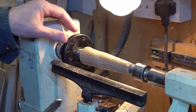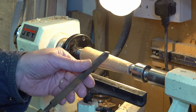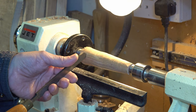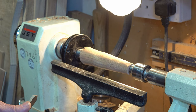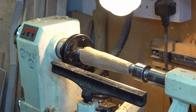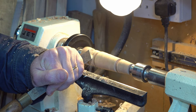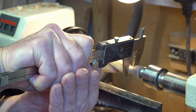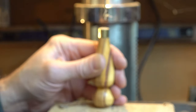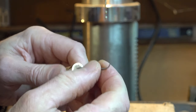I'm developing a bit of a technique for these — this is number three that I'm doing — where I just get them roughly round and then use my parting gouge to mark where I want the parts, all roughly by eye, and then I use the skew chisel to do the shaping. It's now 9.4mm which is pretty close to where I want to be — a nice tough close-grained wood, so I can now get that blade in.